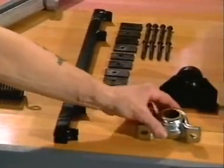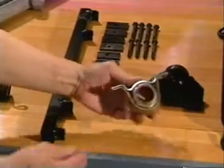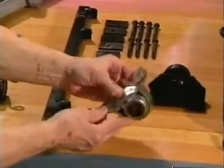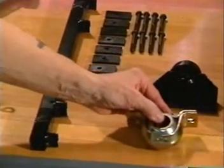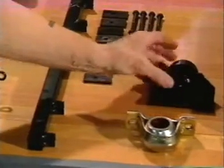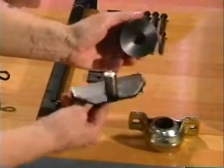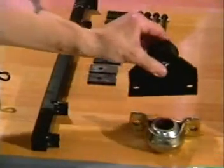The torque tube weldment that supports the table on the earlier machines is mounted on pillow block bearings. So we would inspect the condition of the bearings, replacing as need be. These are lubricated for smooth operation. Later machines replace the pillow block bearing with a phenolic bearing, and we use this angle bracket with a pin to support the table torque tube weldment.